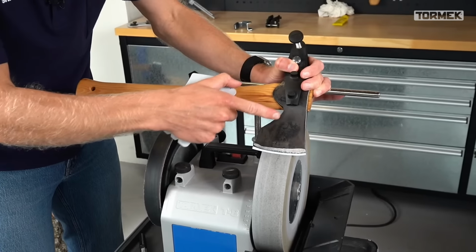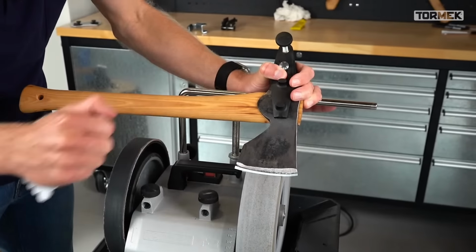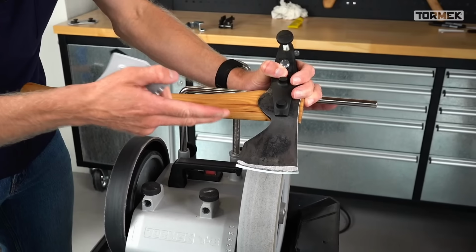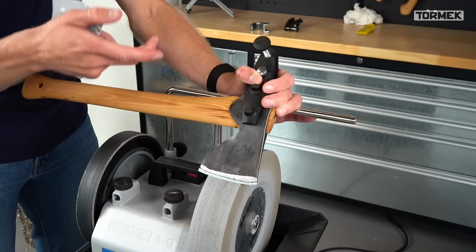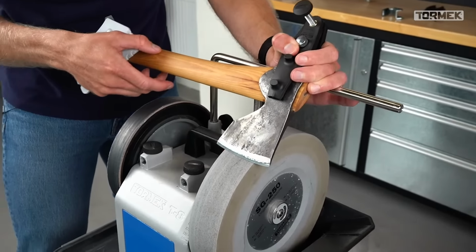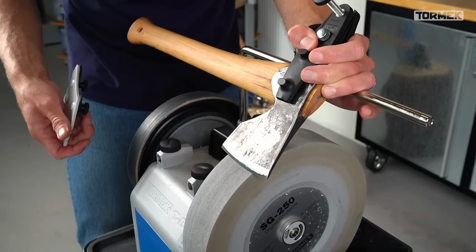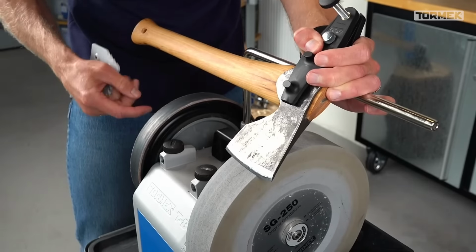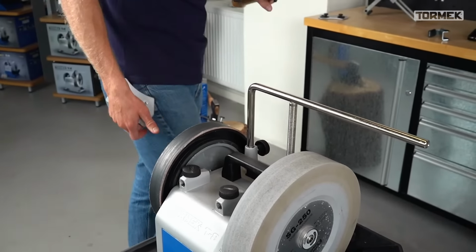Right. And here it's on knives. Sometimes people are used to measure on the back of the knife. This is not possible when it's so rounded and tapered, the axe. So to be able to use the WM200 Angle Master, you have to be able to measure on the bevel. Exactly. Cool. But that is also a possibility you have.